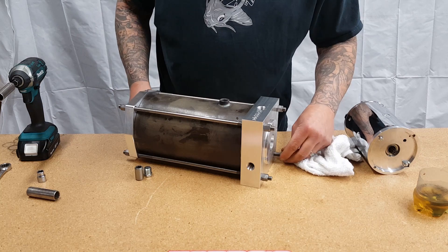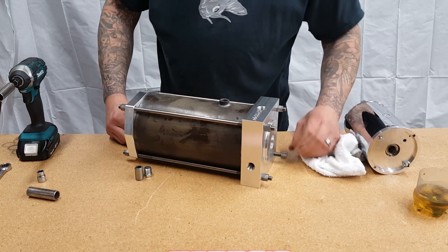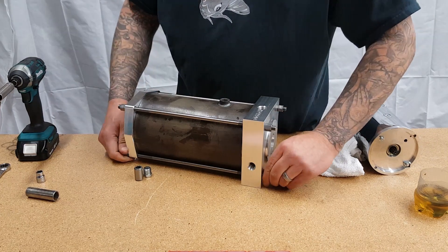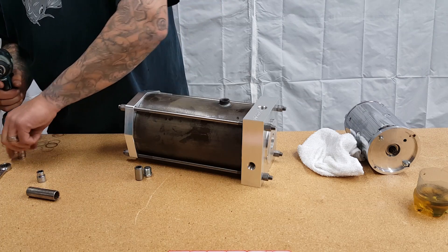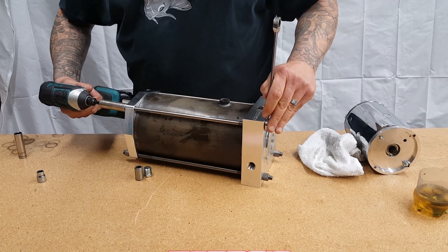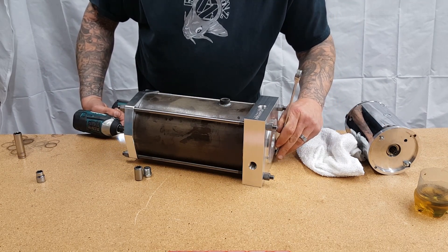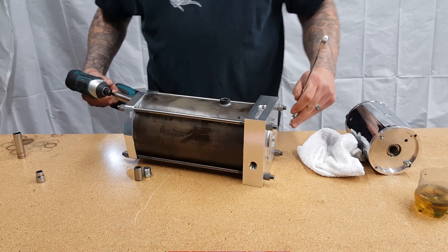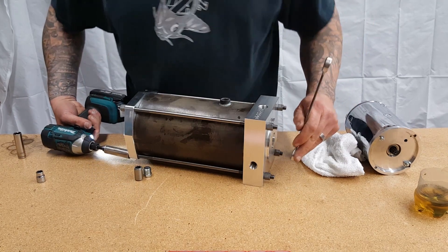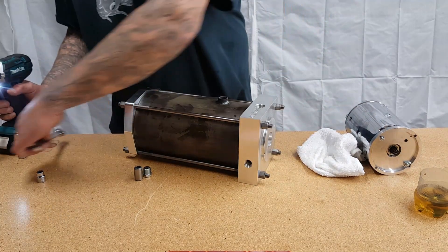He's going from left side to right side, alternating on the threads, and the reason he does that is to get the rods even on both sides. We do our rods slightly longer so you have the option to do a secondary nut. The nuts we use are slightly bigger than your standard nut you'd find in a hardware store. He's holding one side with a standard wrench and going with the impact on the other side, tightening it up at opposite corners — that way it pulls the o-ring down evenly from the block and the backing plate. On this you're running extra o-rings compared to a standard tank.